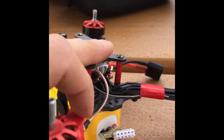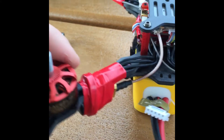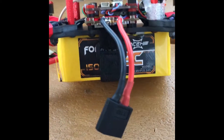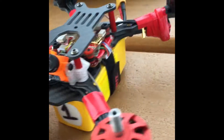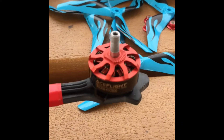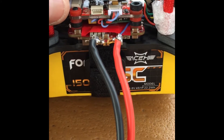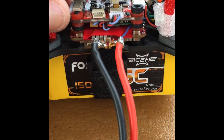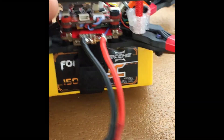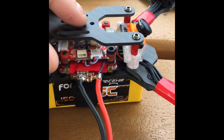Here's how I built this stack: connecting the ESC to the flight controller, I got my RX right there — Spectrum telemetry — I got the flight controller, and I got the VTX. Very simple stack. I got the antenna coming out the back. I'm running the AC Formula Series 95C battery for now until I get the 5150s. I've been testing this — ran about six packs today. OSD is working, everything's working. The 32-bit Bolt ESC can run DShot 1200 — everything on there is super solid.